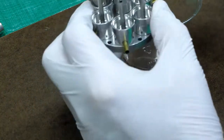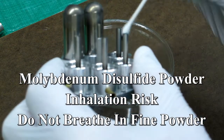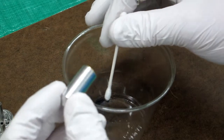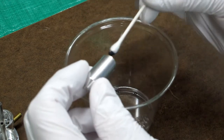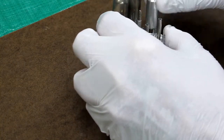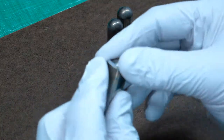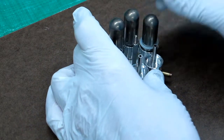Putting this together again is a little bit of a chore. I'm taking the molybdenum disulfide and putting a little bit on that shaft with a Q-tip, and then just a little bit in the center of that displacer. That stuff is pretty slippery. Displacer tube — put an O-ring around it, slide that down in there.